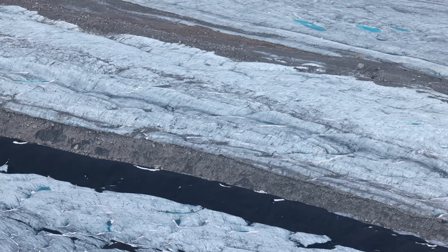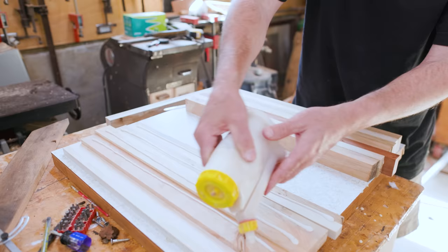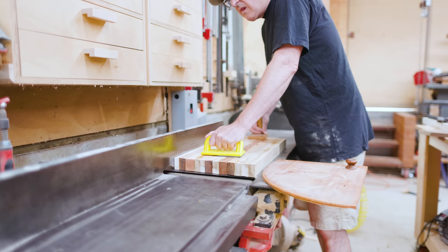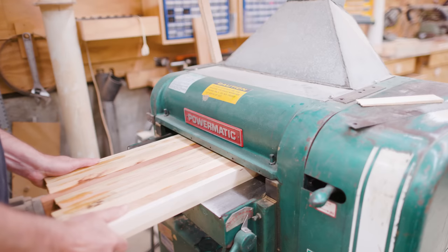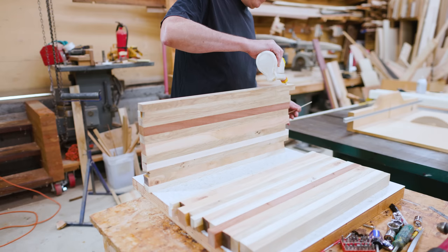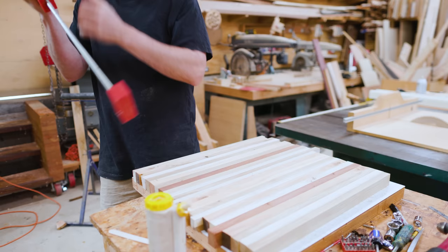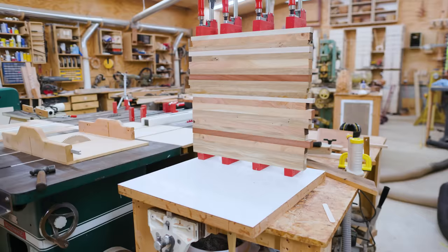I could see this in some of the striping in the glaciers we saw. I rotated all the pieces and I can put glue in all the seams. I made two sections at this point — the full glue-up is going to be much too wide for my jointer. So once I'd scraped the glue off I can joint one face then plane the other face. It's really nice having this new cutter head — it's a really good surface and I don't get any variation in the thickness at the end. Then I can glue those two parts together, and in joining those seams I flip the pieces around so the top and bottom match up. Even if the jointer's off by a tiny amount, as in not perfectly square, it'll still give me a flat final piece.